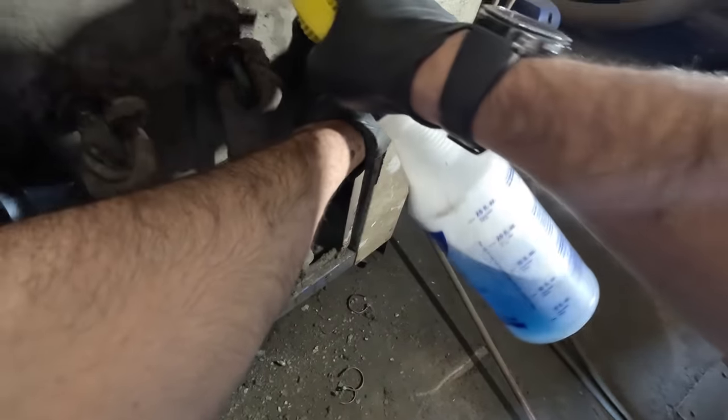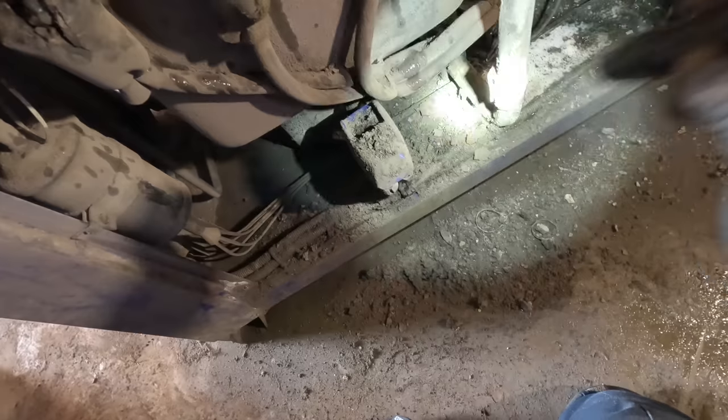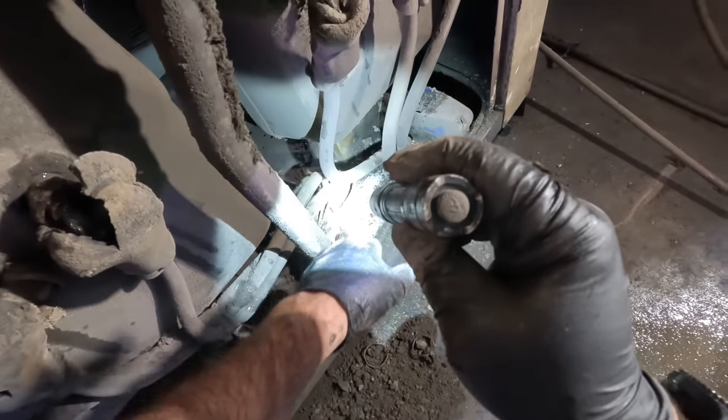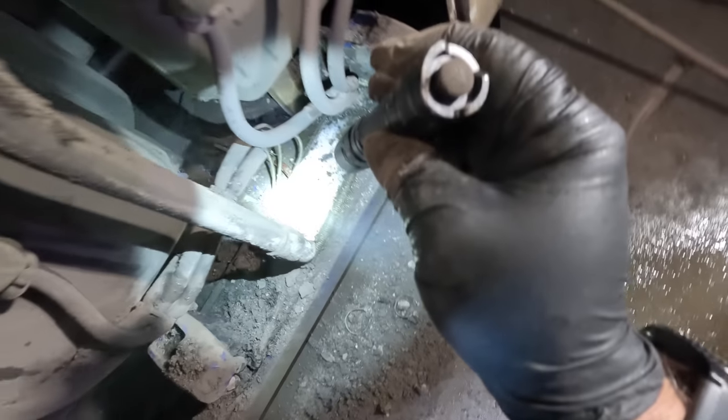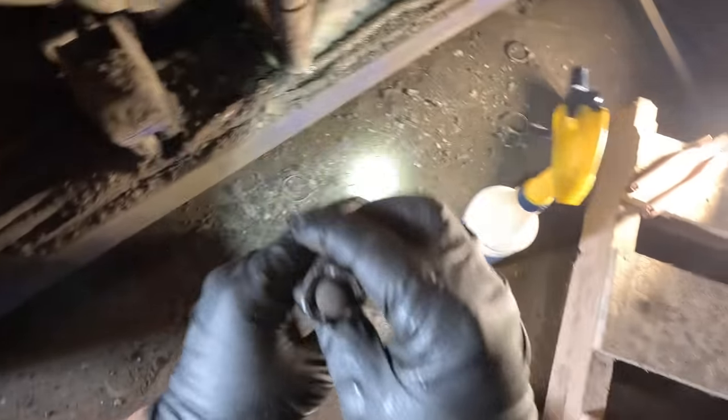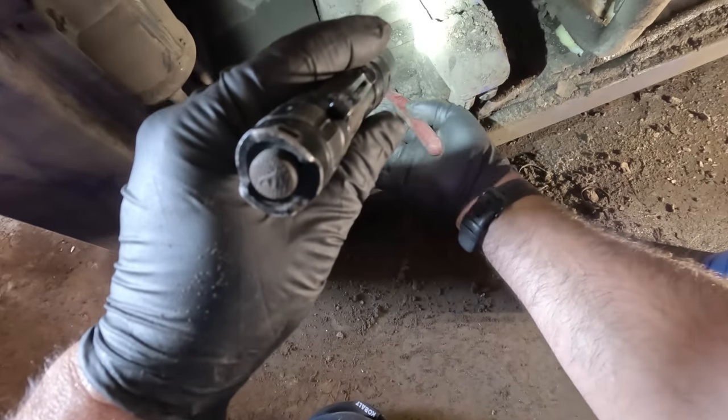The system never got completely empty. I'm going to pull the pressure off. I'm going to use a small piece of quarter-inch, probably sleeve it after cleaning it up, then braze on both sides of it and put her back together. This is why I like wearing knee pads — that way when you're down in this nasty stuff it keeps some of the crap off your uniform. Let's get this wire tie stuff cut loose so maybe I can rearrange these.